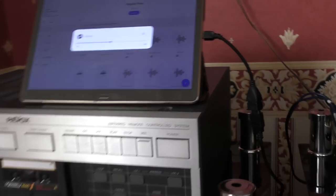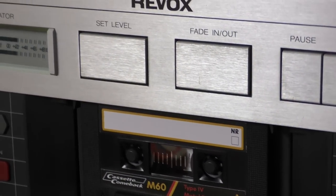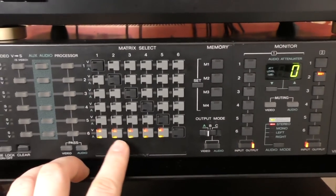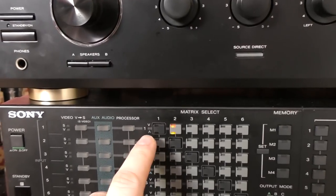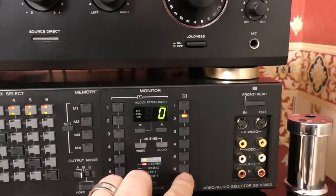I can also play a tape and demonstrate further. This multi-fuel music tape is being played from deck one — I'm monitoring deck one. If I switch to deck two we hear nothing, because all are switched to input six. Let's take it off six and go to input one. If I select deck two, the Dragon, and press two, there we go — the Dragon is now taking input from the Revox. Likewise I can do this on all the rest of the decks. They are all now taking input from the Revox, so I could do five copies of whatever's playing on the Revox.